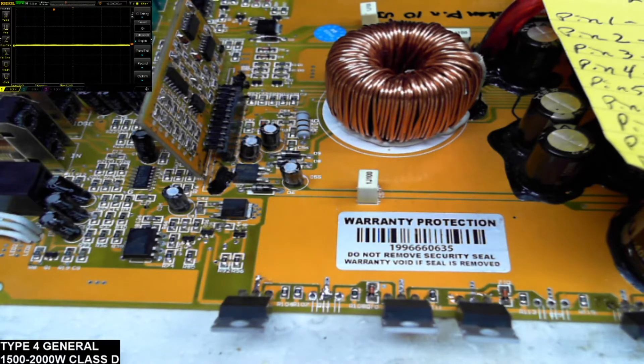This board is all wired up right now, otherwise I'd flip it over and show you the jumper I used. I just took a jumper off pin 10 on the bottom side of the board, direct from the pin, over to this VIA which completed the circuit going back to R56. That brought my low side drive back.